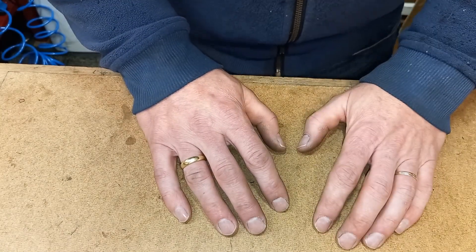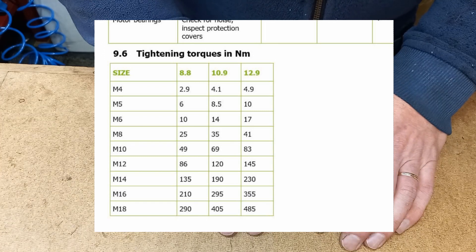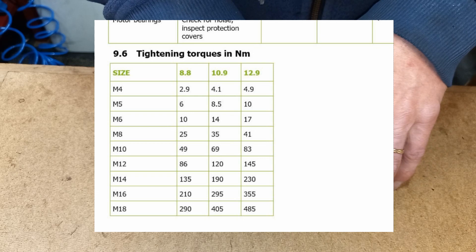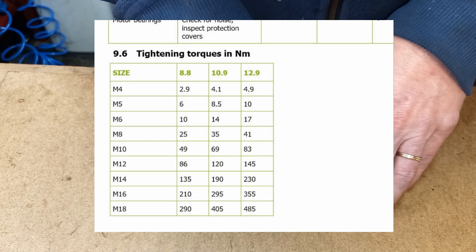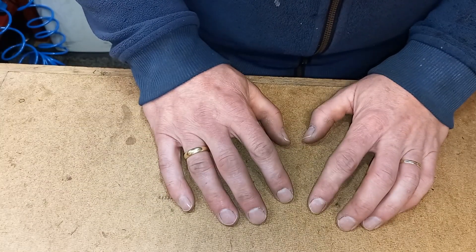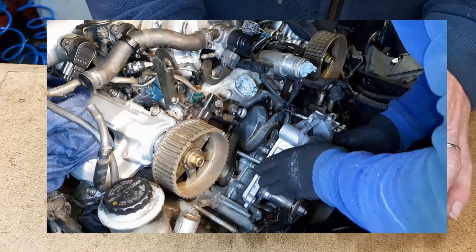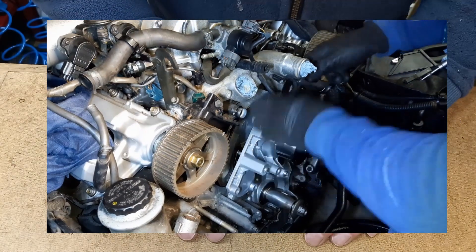Number 1: I often use the specifications supplied by the manufacturer of the bolts and nuts. If you know the thread specifications — like pitch and diameter — the grade and the material of the bolt, it's just copy-paste from the manufacturer's specifications. Number 2: when using lightweight alloys and metals, I determined the torque specs by feel — tighten the bolt until it's good and tight, then measure the breakout torque, and use that number in the manual.